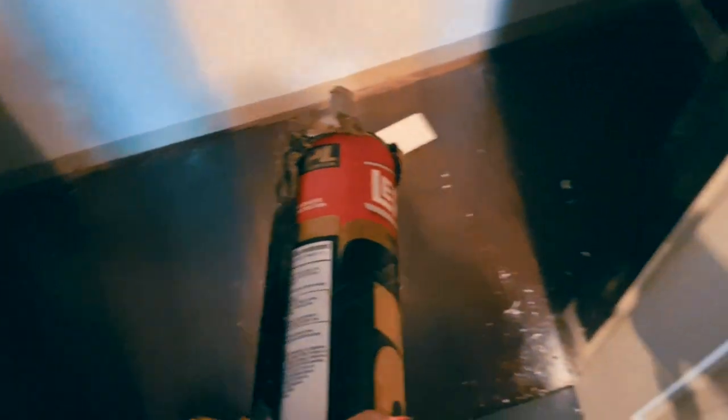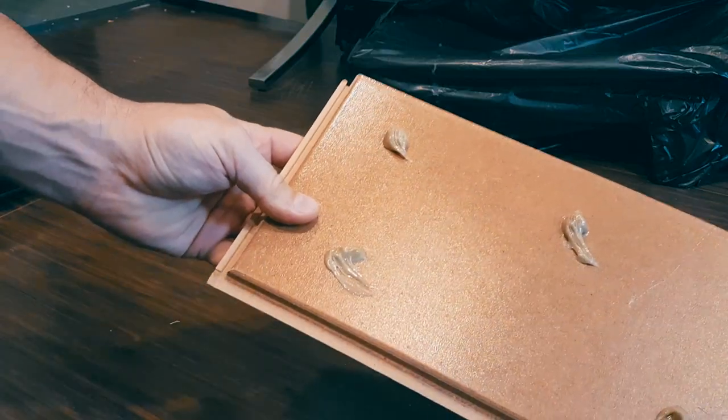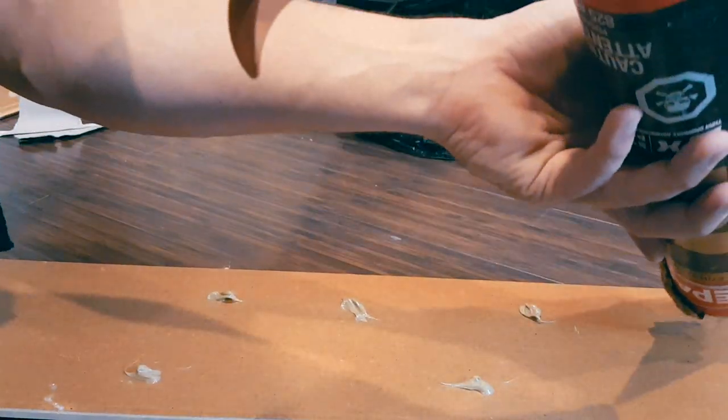Now we have a straight floor, so we're just going to follow the floor by placing the plank at the bottom and then working our way up. It's just really to get them to stick, little tiny dabs like that. So now I'm going to grab the big one. Now it's very important that you place the plank with the lip sticking out and the big lip on top when you start. This will make it easier when you're building your way up. So, like this.